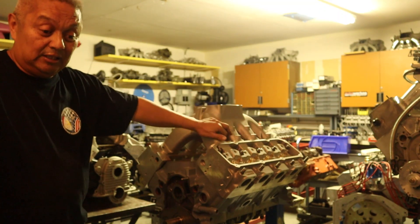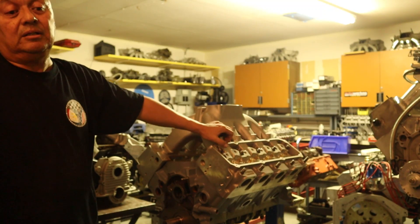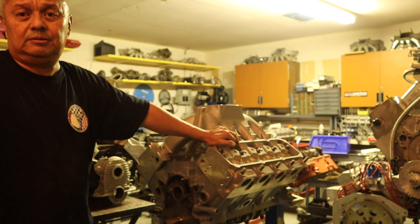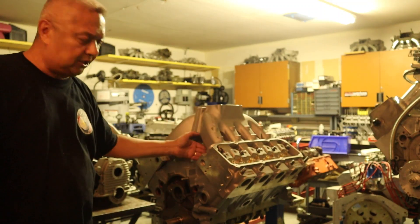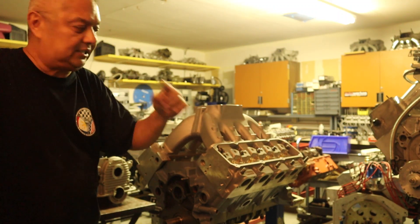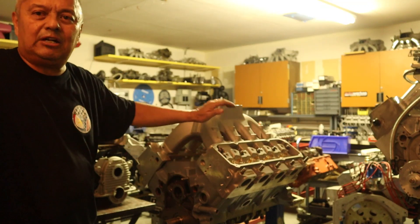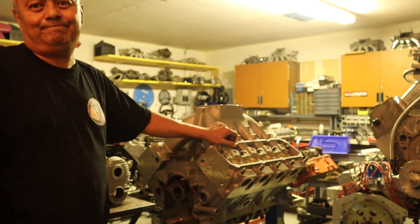Every time you pick up air flow without enlarging the port — just by taking off the bends or intrusions — you're going to gain power. They made this manifold out of fancy material but followed the factory layout where the injector is in the most streetable position possible. Great for the street, but this was a race car — an SLR manifold. I told them to put the injector underneath, away from the air flow, and then you're going to have what you're looking for.